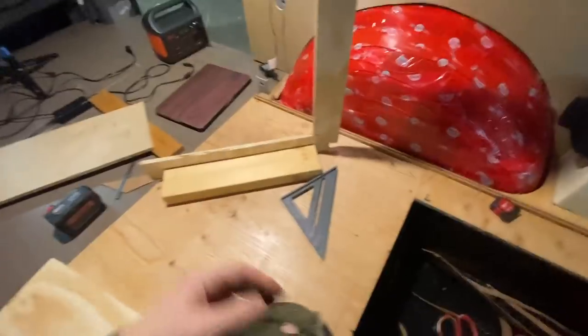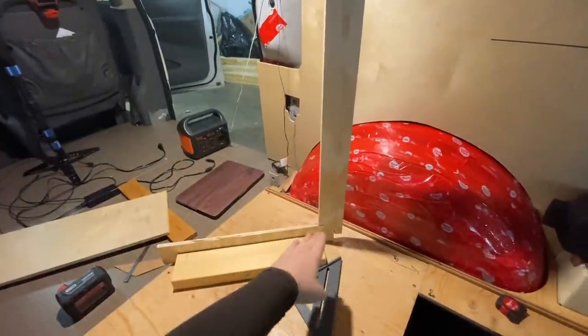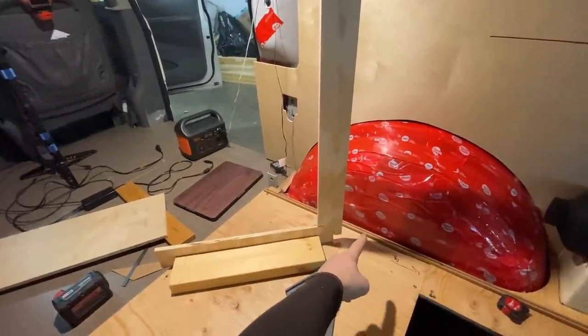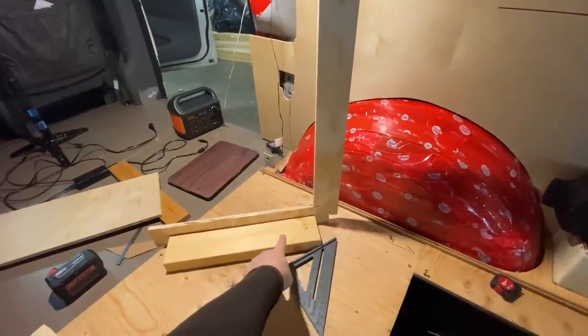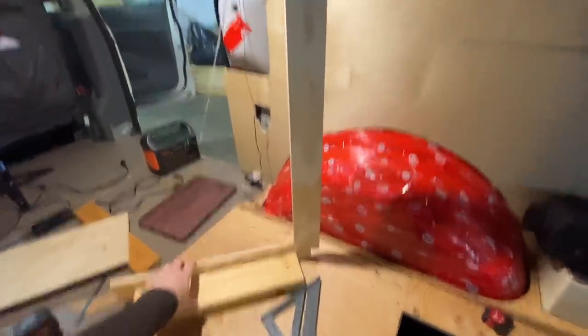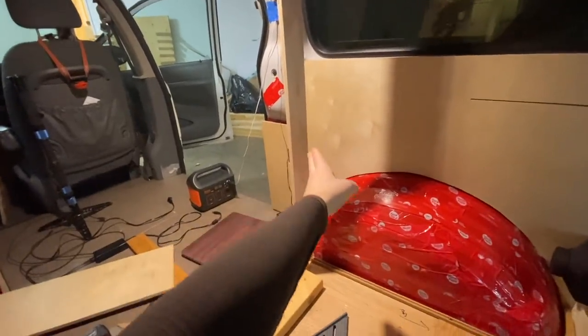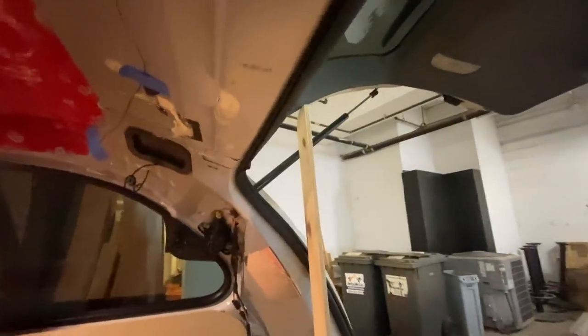So I just built these squares, and all it was from a factory cut piece of plywood, and I just ripped down the inside and the inside there, and then notched out the back corner so that it could fit over that little trim bin that I've got mounted on there temporarily. Then I mounted a 2x4, screwed this on to the side so that it could stay upright like this. In relationship, like floor to ceiling, that's giving me now a fairly true, good enough in this particular case, line that is square with the floor. And I've got one for the back as well. Now it's just popping out like that, but that's fine.